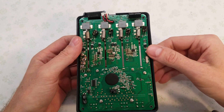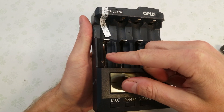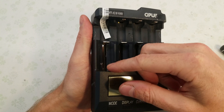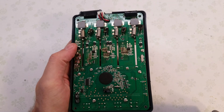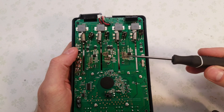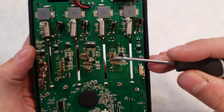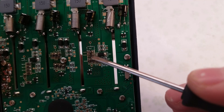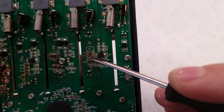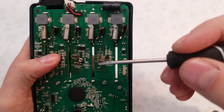The reason why these stop working is because as it's testing cells, it's burning off that energy as heat, and that's how it determines what the capacity of the cell is. 90% of the time when these fail, it's because one or more of these discharge resistors has fallen off or has a cold joint. Looking at this charger, you can see the resistor that belongs right here is missing — I have no idea where it's at, it's not floating around in here anywhere, there's no rattle noises.